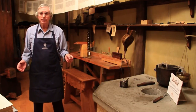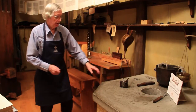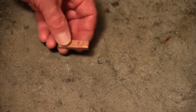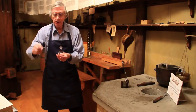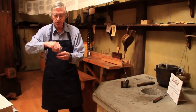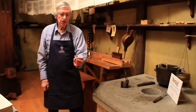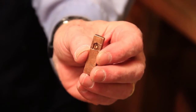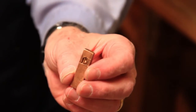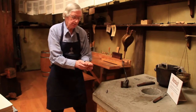But what does he make his mold out of? He can't use tempered steel of course, but there were softer metals. He finally came up with copper. Compared to tempered steel, copper is rather soft, but it's still a hard rigid metal. So he placed his hard punch letter against the softer copper and struck it with a hammer, making an impression of the B down into that metal. When he pours metal in there, it's going to go into that sunken area and take that same shape. So now he has his mold.